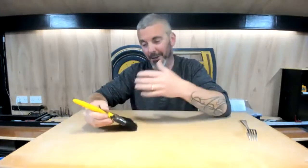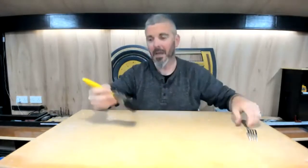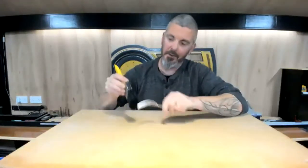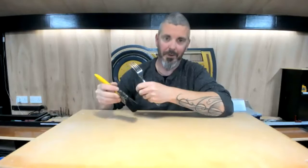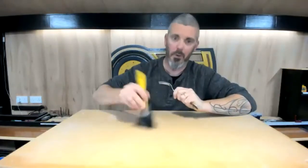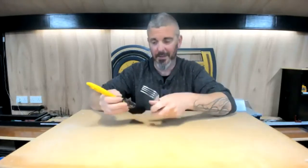So you'd be much more advised to clean out your brush with the tap running on it, brushing it underneath the water. You're not upsetting the bristles. You come along then with your fork, and in she goes, and you're breaking that paint out from the inside, because you don't want paint drying in there, as it's just going to start sticking bristles together. So you go like that a few times and then keep washing. That brush is as clean as it will ever be. You want to agitate the bristles and get them separated.